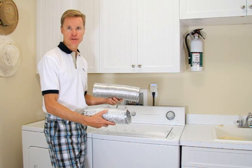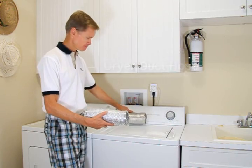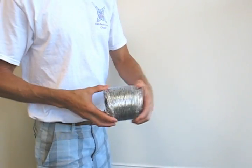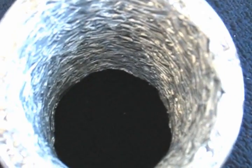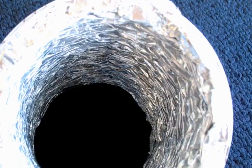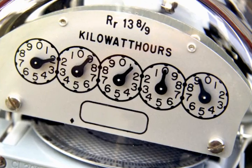In the industry, we refer to them as transition hose or dryer duct hose. The wire-bound foil flex is very easy to work with and has an impressive stretch to compressed ratio. But since the foil material collapses or folds within the opening, the 4-inch space shrinks to a very abrasive 3 1/4-inch opening, increasing the airflow friction and therefore a poor choice when considering efficiency.